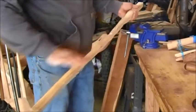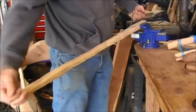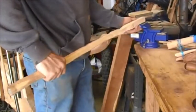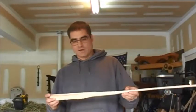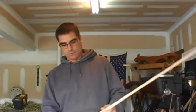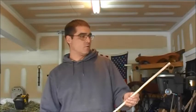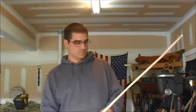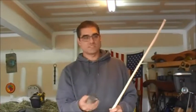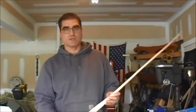We'll take down some of the first side and then just flip it either 90 or 180 degrees and start taking down more of the other side. We've only been working on this for a few minutes with the draw knife and we're already down to more or less the shape we want. I keep the handle nice and big because we'll finish that differently after. Now I've also got this small rasp and I'll run that up and down to make it a little bit rounder, then we'll finish off the handle.